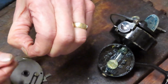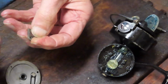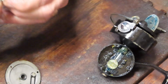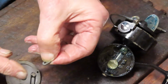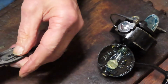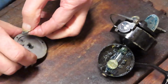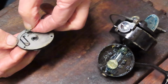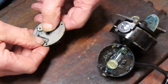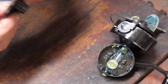We have the J spring, we have the 90 degree facing up. We're going to want to take the dog, properly oriented, put the 90 degree spring in underneath, and then get the clearance for the stud so it looks like this underneath. Once we have that stud set up, then we want to just take the assembly and load that over the hole over the stud. Just like that.